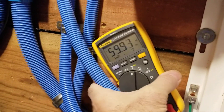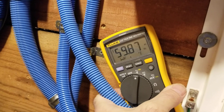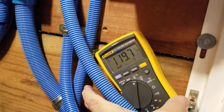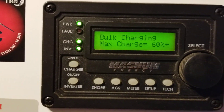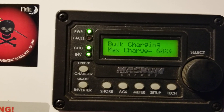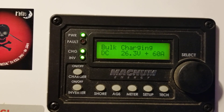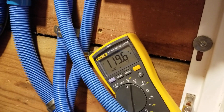I need a cameraman. I'm at 59.9 — very close, which is good. And the voltage range: 119. I think this inverter charger is going to like it better. It's not that critical on the cycles, but the voltage sag is an issue, and it isn't bad if I have it first start out at 124 volts. But when I'm under load, as you can see, it's at 119. So let's increase this.